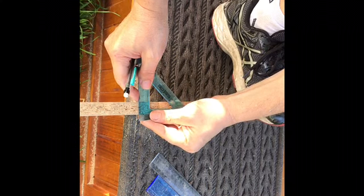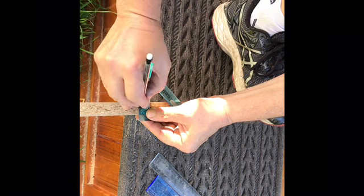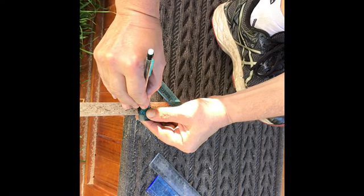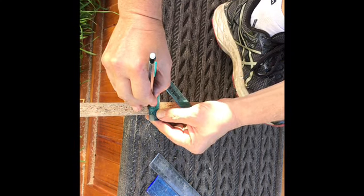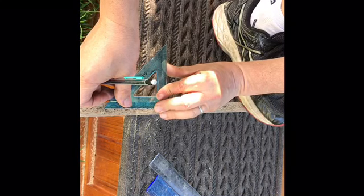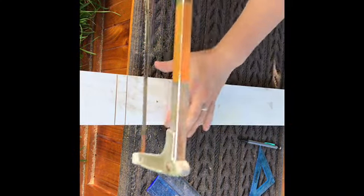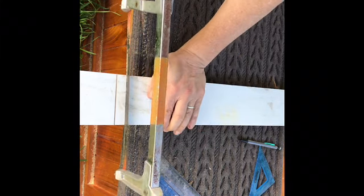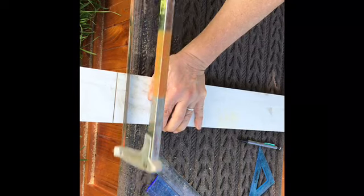This chipboard is 20mm thick, so I'm going to go down 10mm. Make a nice depth mark on both sides so you know how far to go. Get down lower so you can see the depth you're sawing at - it also helps you to keep things level.